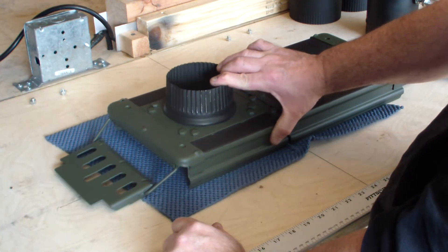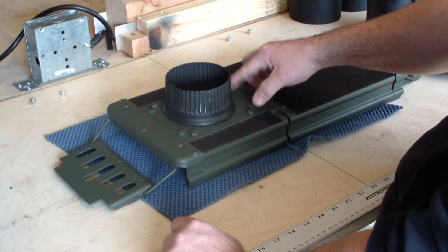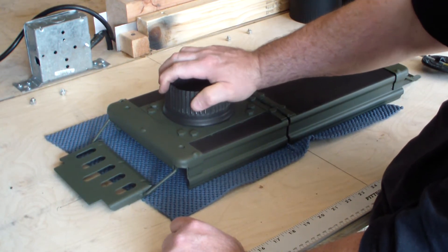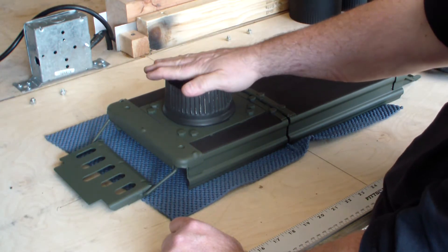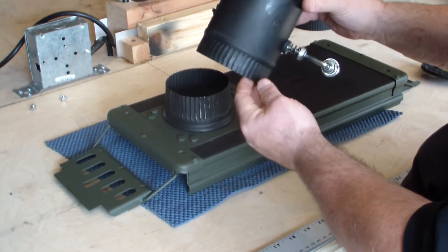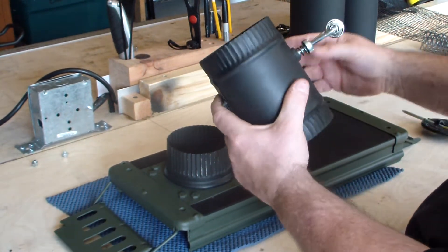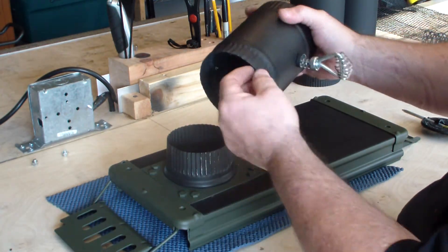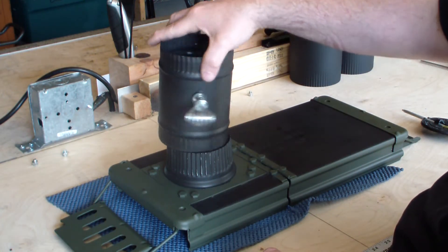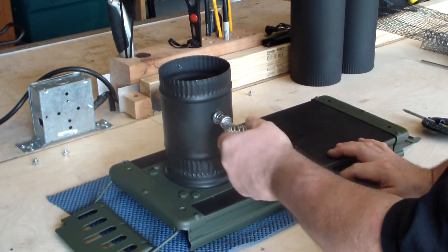Getting back to the stack — once I pull those tabs back onto this piece of metal, I put the metal on top of the lid, bolt it down, and now it isn't going to go anywhere as you can see. There needs to be a transition and a place to put your damper, so that's where this section comes in. This is four inches — symbolizing four inches — and this is pretty simple. You can see how it's all crimped, and you just put this onto there and you have your dampening ability.